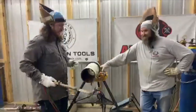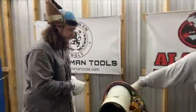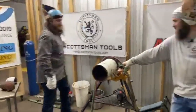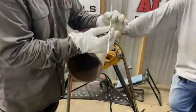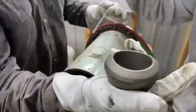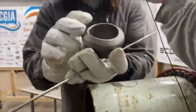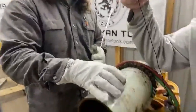Nick just gave y'all a shot. We got our line marked out. I'm going to show y'all a couple tricks that I've picked up over my years. If you got a Sharpie, that's great. If you don't have a Sharpie, take you a TIG wire, 3/32, 1/8, 5/32, whatever. You can sharpen it to a point. If you see real close here, it's really hard to see on this one, but you have a dip in this weld-o-let here. You got a little belly. So, we call that the saddle. I'm going to set that on there to where it's saddled to the pipe.